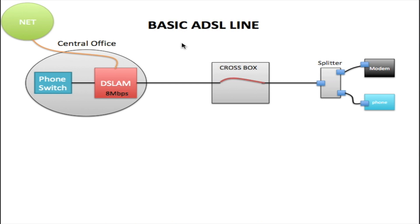Here we're going to be talking about a basic ADSL line. An ADSL line originates at the central office, where we have the telephone switch. Your particular telephone line comes out of the telephone switch with your phone number and your dial tone, and it's connected to a DSLAM card. That DSLAM card is also connected back to the internet. Your telephone line is connected from that DSLAM card to a cross box on the street, located approximately two kilometers from the central office. The service technician connects the dial tone to another cable going to the subscriber's premises. At the subscriber's premises, we have what we call a splitter, and the purpose of this splitter is to isolate the modem from the phone line to prevent interference between the two.